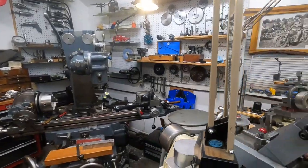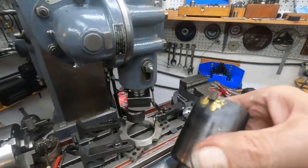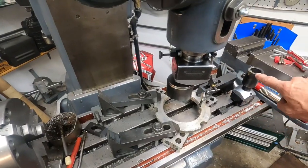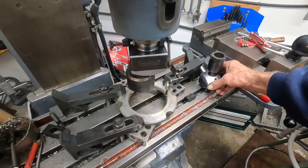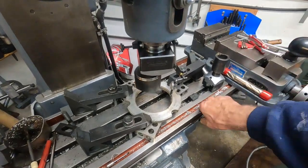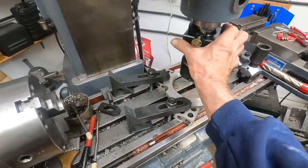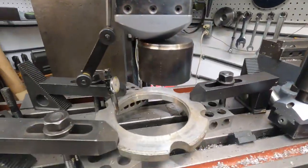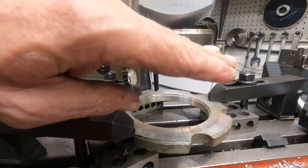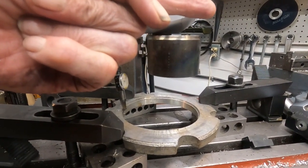Here's another one — this one's extended, a little smaller diameter. You can take this type of tool and put it in a boring head and keep the boring head centered. I'm going to make a whole bunch of these; I've gone through a bunch of them — I break them, I lose them, some I've got to put new carbide in. Now this is a little more of a twist on that same theme: same thing but I offset the shank. You see how it's kicked out that way? This makes a pretty rigid setup — often better than sticking a slim bar out sideways on the round heads.